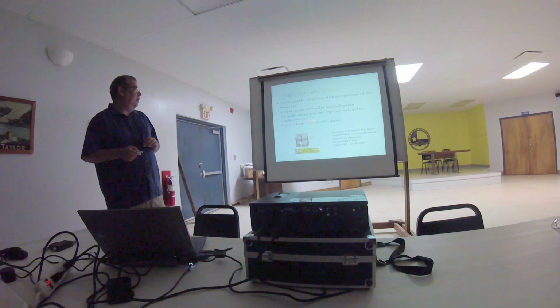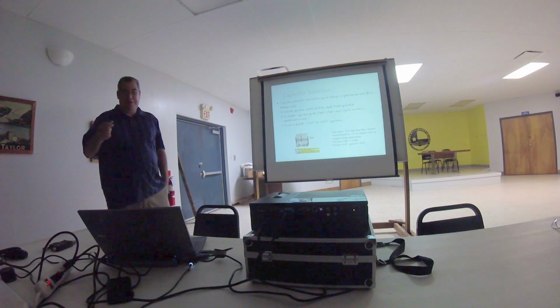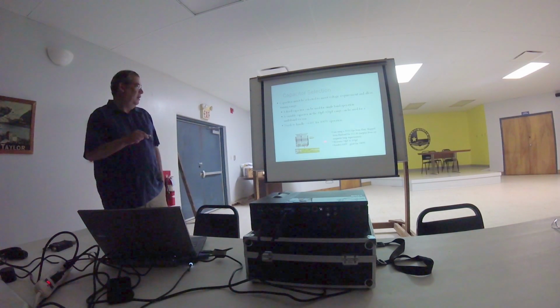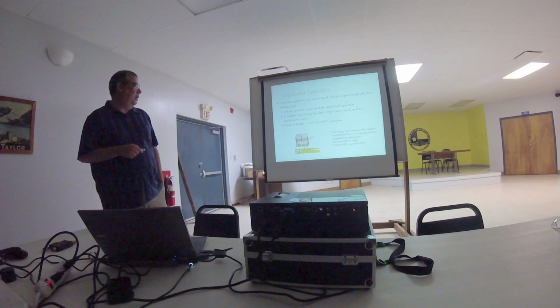In this case, we need to handle about 650 volts for a 100-watt operation. What I'm using is a new old stock Alps variable capacitor that I got from eBay. For some reason, they're shipped from Thailand. They cost $12.50. It was surplus from some of my early mag loop experiments. Clearly not suitable for more than a QRP mag loop, but for this application, it works really well.